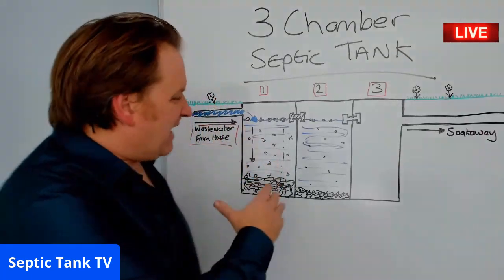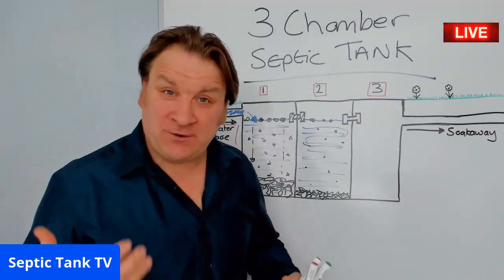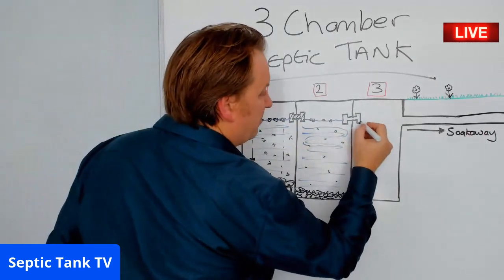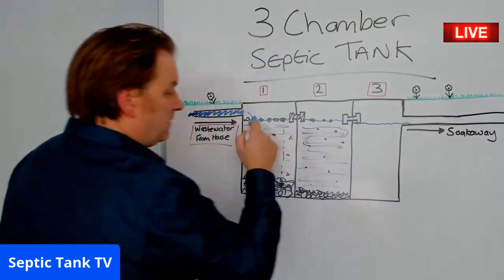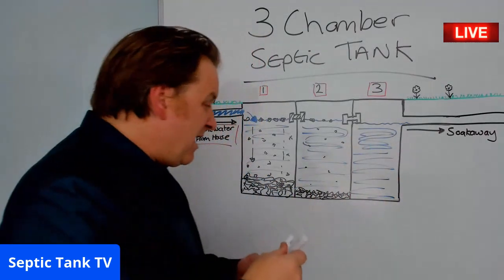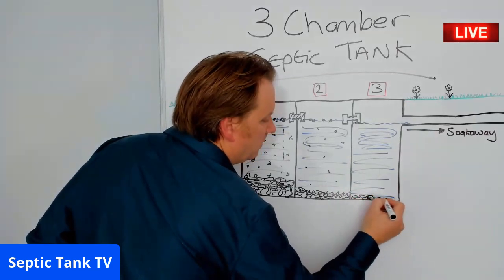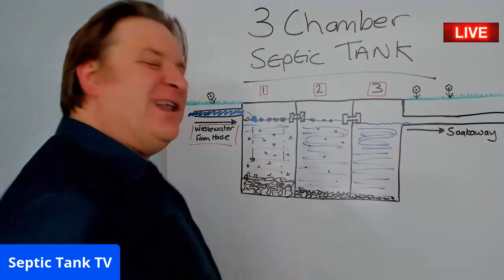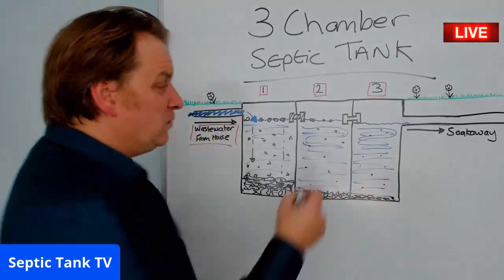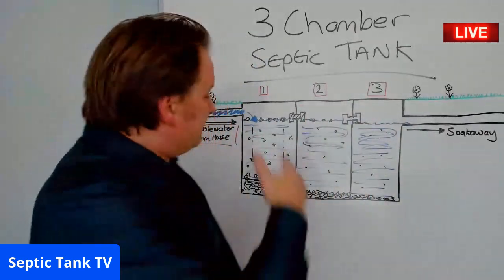What it's actually acting like is a filter. The more chambers you've got, the more you clean the sewage effluent before it goes to the soak away, which we'll talk about in a moment. In chamber three, the water steps down again. This is the last chamber. You'll still get some debris that makes its way through, but it'll be a lot less than chamber two and a lot less than chamber one. You'll still get a bit of suspended solids in the water, but it's a lot less than chamber two. And you will get a tiny bit of debris floating, but it's been filtered and screened a lot more than when it first went into the tank.